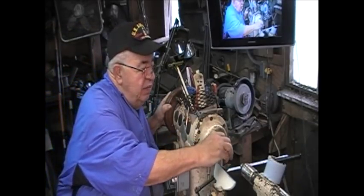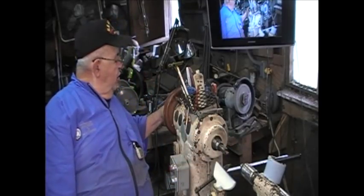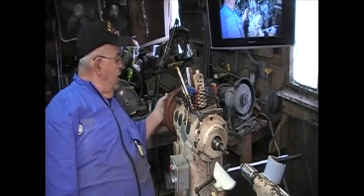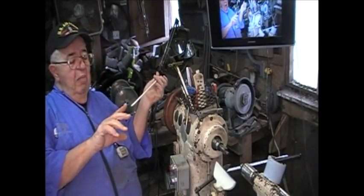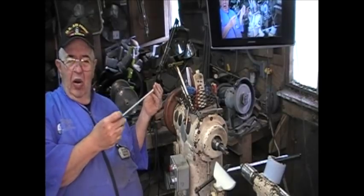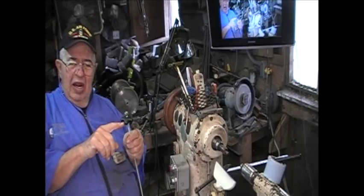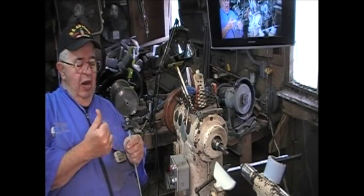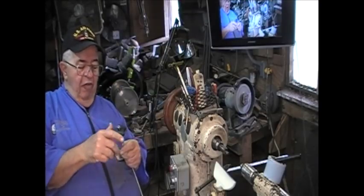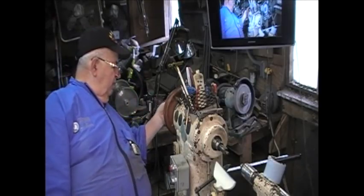Morse taper goes in. We get it down in there, just snug. Then we go to the other end, and we take this 1/4-20 rod that I've got. I bought this at a hardware store a little while ago. I bullet nosed the end of it so that I don't mess up the threads, and I did that on a bench grinder right there. And then I put a 1/4-20 stay nut. See the little spin around nut? And then I put two 1/4-20s on the end over here to keep them from coming off. So I back it up and turn it. It doesn't come unloose.